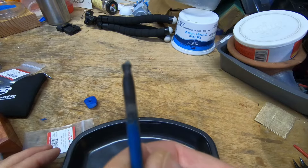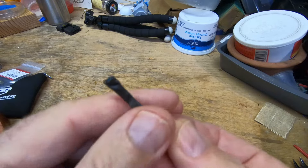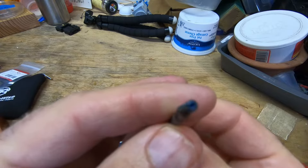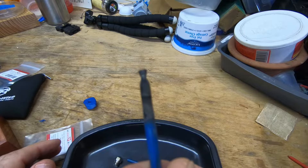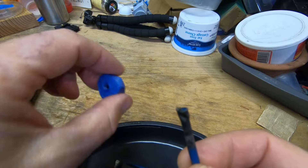This is what the heatbreak nozzle looked like when I pulled it out. The end is all squished because when you pull it out, I used my tweezers and my needle-nose pliers, and I had to squish it to pull it out. But you can see it's pretty well burned there, and there was filament built up in the end, so that's what caused the extrusion problem.